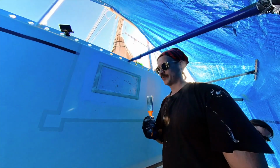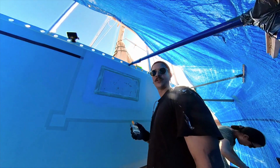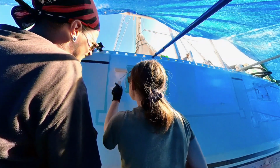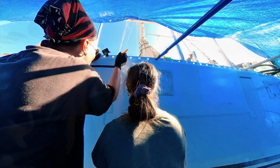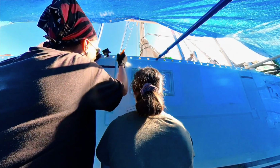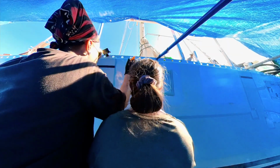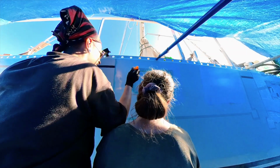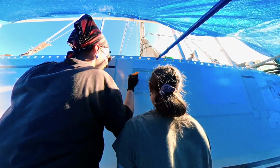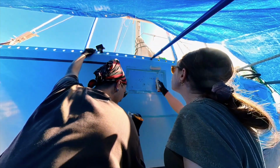Okay, I'm putting on the top coat, International Toplac, with a rolling tip. Kira is applying the paint in a thin layer with the roller, and I'm using very soft strokes with a brush to even it out. And apparently this is the best method to get the clearest, cleanest finish without spraying, because it should be shiny and nice. And I think, oh yeah, I can see how I get rid of the bubbles.